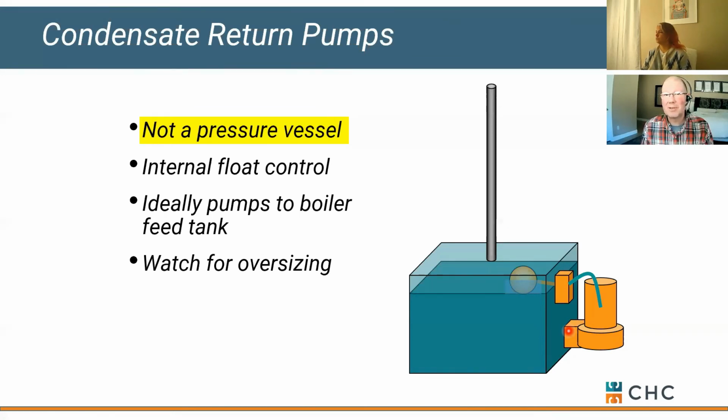Efficiency, it's not 100% efficient compared to condensing boiler style. It's also a very forgiving system. You can typically tell a steam job when you roll up on it. Most of the windows are wide open. All the classrooms are very warm and hot. The comfort control can be questionable. Honestly, trap maintenance is one of the real sticklers or problem sources for most people on a steam job. It depends on your campus and what you're trying to accomplish. The uses vary. But yeah, good question.